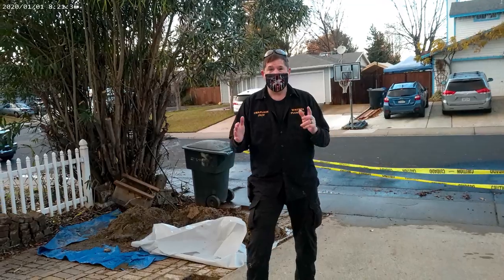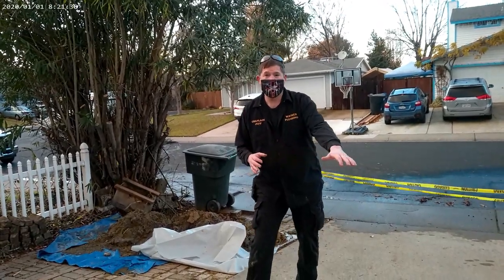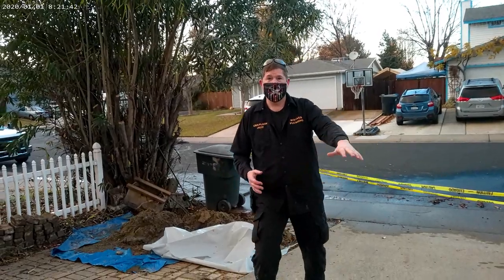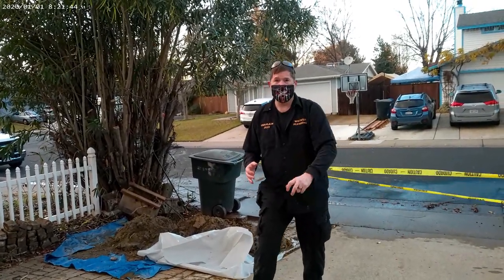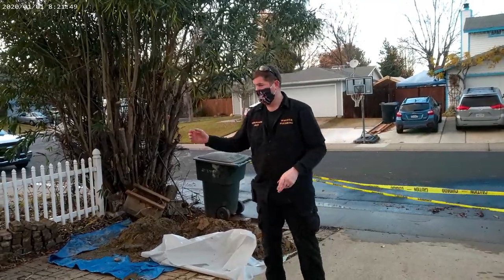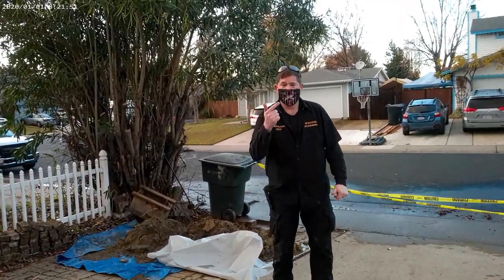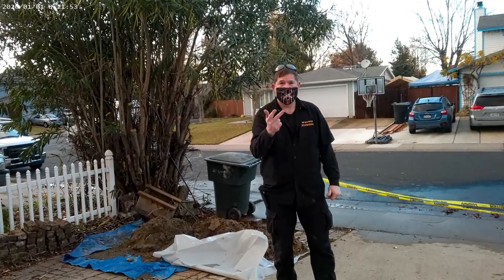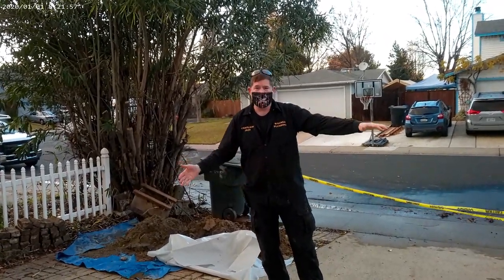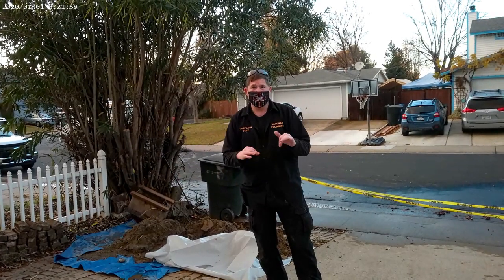Trenchless is a bonus, in that you can do trenchless and don't have to redo your driveway. When the water main runs through the driveway, you don't want to tear up the driveway because it's leaking under the driveway. The trenchless system is the way. In this case, they had gas, utilities, cable and some kind of fiber optic wires running through the property. So the trenchless system is the way to go.